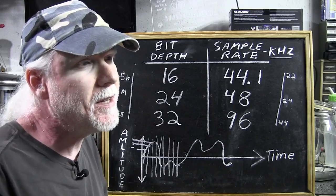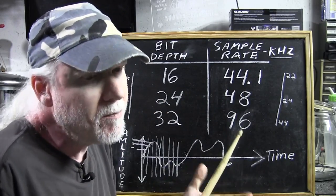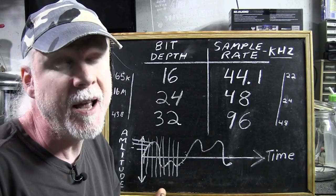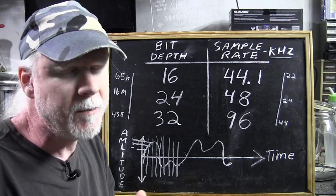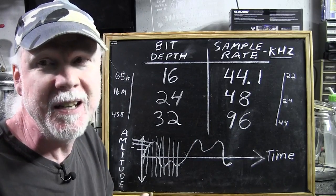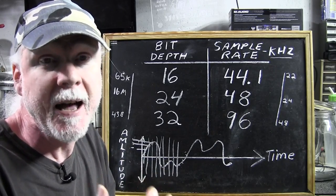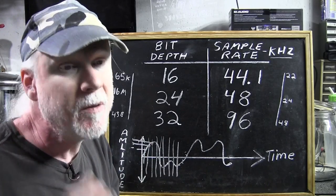The only thing that people concern themselves with is that when you get close to the upper limit of the sampling rate, you start to run into some quantization problems, and they have to start filtering it inside the converter, and things can, not always, but then they can get a little bit problematic, and you can end up with what are called beat notes. You can end up with some sorts of distortion, aliasing, and all these weird sound effects that give people the nail on the chalkboard thing when they listen to a CD. Some people can't listen to CDs because they think they can hear this distortion, especially on cheaper CD players. And that's what gives CDs their harsh sound that some people claim they have, okay? Because if you don't take care of this top end properly, you can end up with weird artifacts that make weird effects happen, okay?